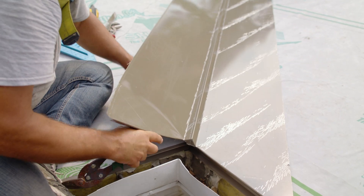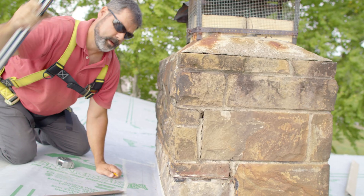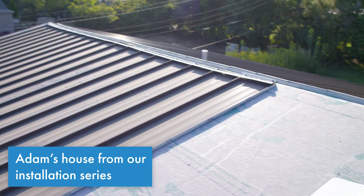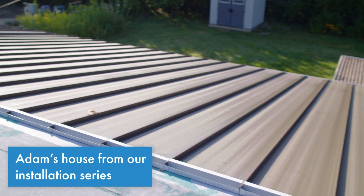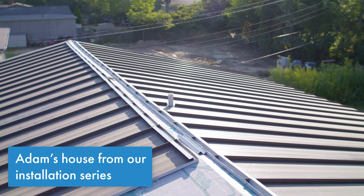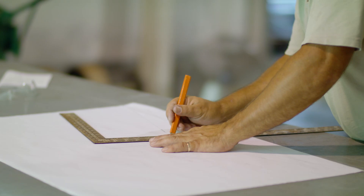You've got another way you can do this — with a standing seam roof. As they're putting the standing seam roof on, they'll have flashings made when they come out, measuring specifically the parts needed for your details, whether that's a rake detail or a ridge. Today we're probably going to be fabricating our closures for the top of our sheets, our ridge — which we've had to measure — and the drip stops for that vented ridge as well. When we went out and started sheeting Adam's house, we were able to get measurements on where our upper sheet closures had to be, then transfer all that to our drawing. We've got the pitch of Adam's house and our closures drawn in, so we're able to take the measurements for our ridge cap and translate that into our fabrication.